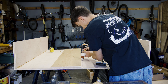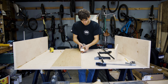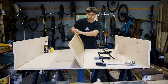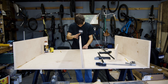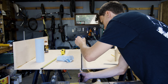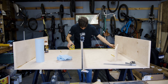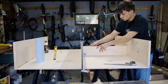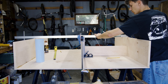What I'm doing right now is cutting two pieces that are the width of the gap between the middle support piece and the outside support piece. That way, once I glue the middle piece down, I can put these spacer pieces in between and clamp them together to make sure the middle support is sitting at a perfect 90 degree angle. If I just clamp and squeeze without anything holding it, it might go slightly too far left or right, so having pieces cut exactly to that width will keep it perfectly at 90 degrees.